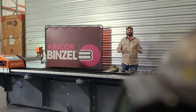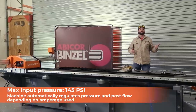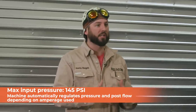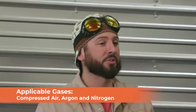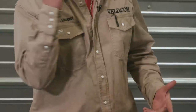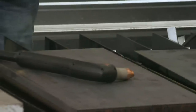Now that we know about safety, let's go over to the table and cut some sheet metal, some plate, and do some CNC stuff. We've got the machine hooked up, power on, and we need to set up the gas. The Extra Fire is pretty sweet — we run 100 PSI to the machine, and depending on the process we select, it'll actually regulate that pressure for us. Same thing with post flow: less amps means less post flow, more amps means more post flow. As far as travel speed and amperage settings, I'm just going to set it to 105 and send it. You can adjust amperage based on material thickness and alloy, but you can also just judge your travel speed and go faster or slower.